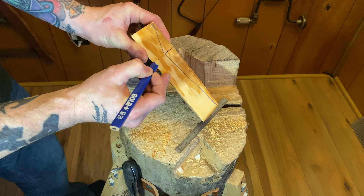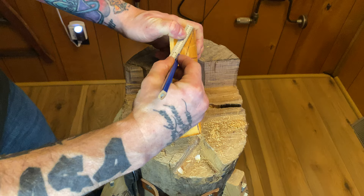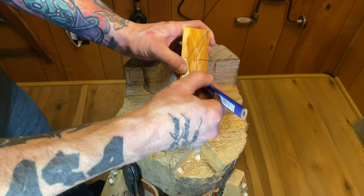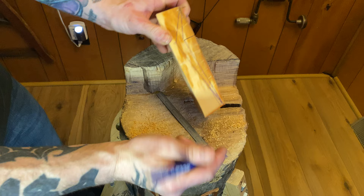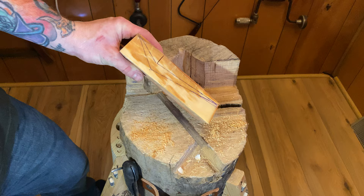You can take it a little farther if you know the depth of your keel — let's say the keel is going to be about half an inch deep. I can make that thinner as I go. I generally like to make my handles pretty thin these days, so some of you might be looking at this going, "oh my gosh, I've got to make a spoon that thin." But that's basically what you're looking for — I always call it like a Nike swoosh, almost a very squared-up Nike swoosh.